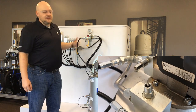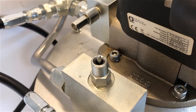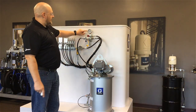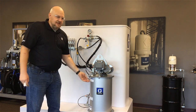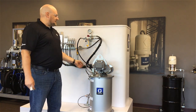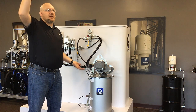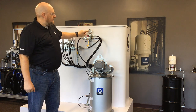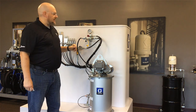This one won't take long because the reservoir is almost full — we can already see the pin starting to come up. Now we can see on our pressure gauge the pressure is rising. The autofill shutoff valve has already closed the flow into the reservoir. All we're really seeing is grease pressure compressing the grease in this line. On a bigger machine with 10 to 20 feet of hose, you might see this pressure rise slowly, but when you see the pressure rise and hear the barrel pump stop — which we can hear it has stopped — we know it's done filling.